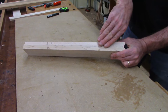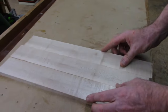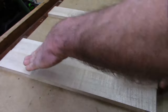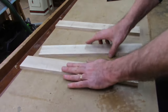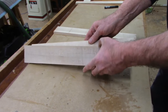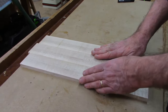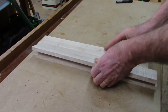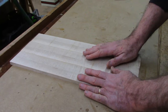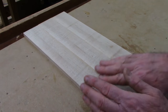What you've got is usually on the side grain, the grain is usually rising or falling. Now, when I lay them out like this, even though they're all from the same board, if I turned one around and tried to get a joint like that, now I might have grain going down and then rising up, because they're both following each other this way. This is the same orientation I can see there. So if I just lay them over like that, just kind of lay them flat, this is like a slip match. If this was veneer, you'd call it a slip match because you're just slipping them alongside each other like that. You're not book matching, where you open them like a page of a book. So by doing it in this method, if you have rising grain, it's going to work out better if you keep them oriented this way.